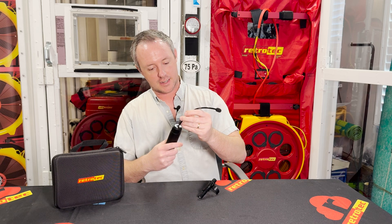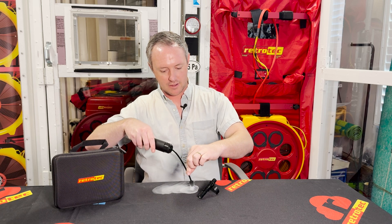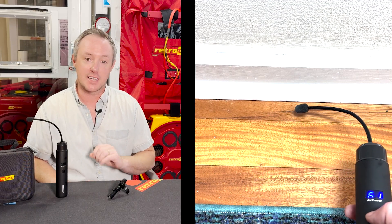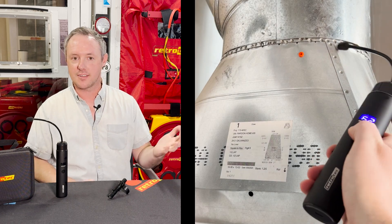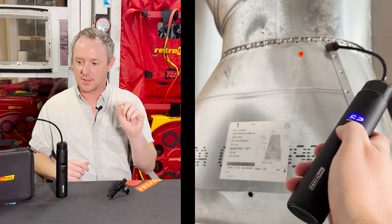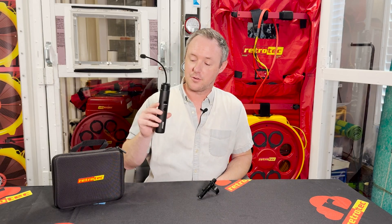One cool thing about the Air Tracer is it comes with a little attachment on the nozzle — it's a plastic tube with a little microphone end — and it just allows you to put the fog right on the ground so it can kind of hover on top of a surface. This is great for going along really fine cracks, maybe at the bottom of a wall. It's also handy for finding duct leakage: if we hook up a duct tester to a duct system and depressurize it, from the outside of that duct system we can go around with this little end, put some fog, and see it disappear into where the leaks might be.